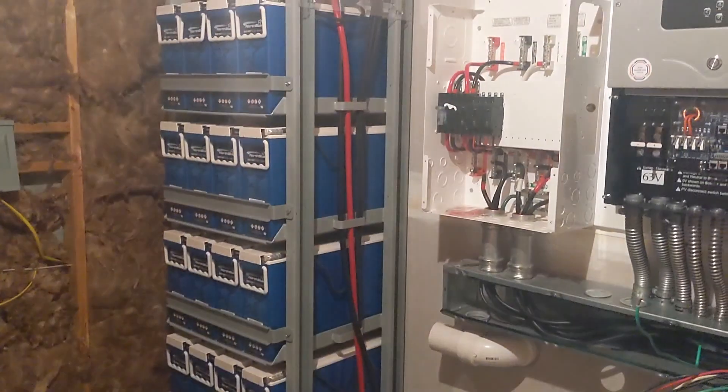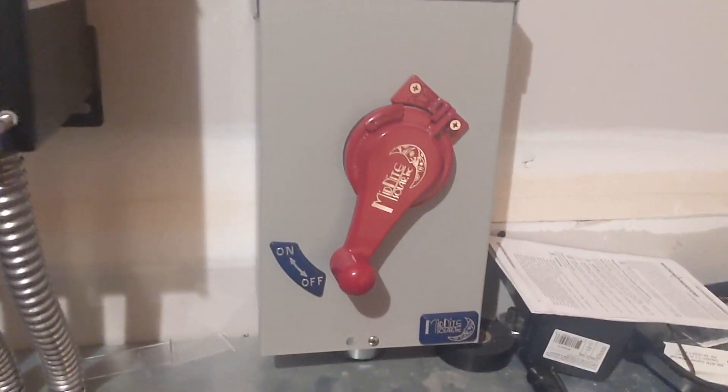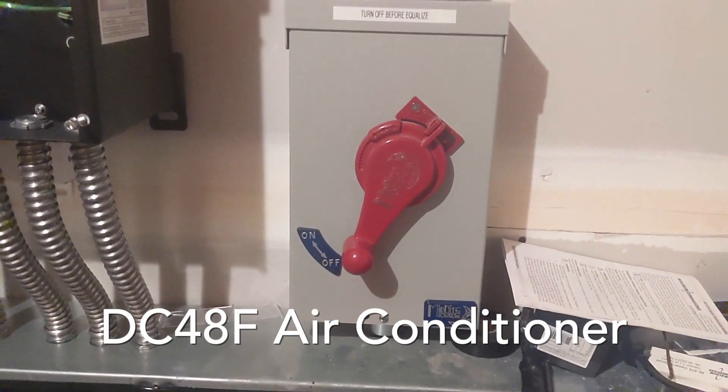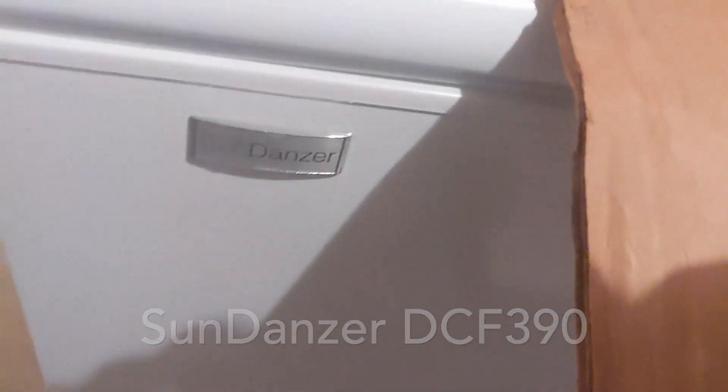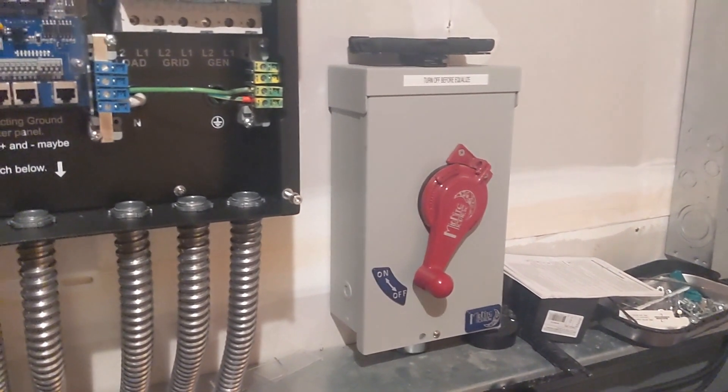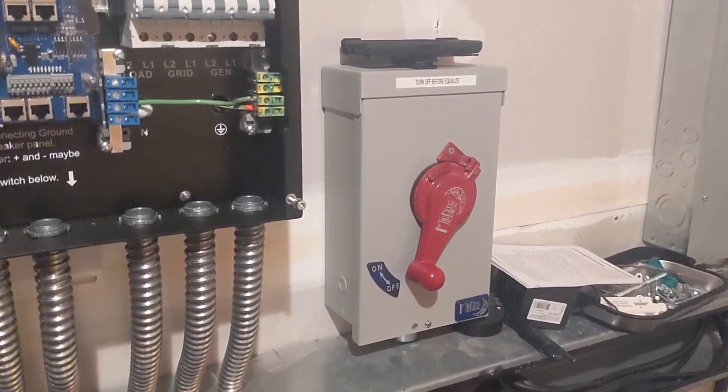This is a great little mech room — bladder tank, water heater, freezer. We've got to do the 48-volt. The only funky thing on this one is we've got a 48-volt air conditioner — it's not funky, it's kind of cool — the DC 48 from HotSpot Energy. That's just a disconnect for it. Then we have a Sundancer 390 — it's a freezer, the largest freezer made by Sundancer — about 14 cubic feet, DC. We're going to hook that directly to the bus bar and run it down the wiring trough, with fuse and overcurrent protection on both the air conditioner and the freezer.